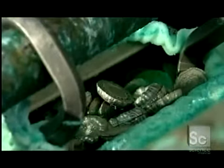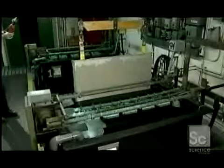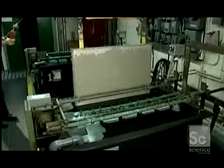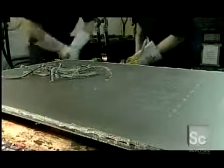Once complete, the engraving will be copied multiple times onto a plastic master plate. Workers coat the plastic with silver so that it will conduct electricity, then submerge it into a bath containing baskets of nickel. They run an electrical current in both the bath and plate. This dissolves the nickel and draws it onto the plate in a thorough and even coat. With the nipping tool, workers remove the excess nickel along the perimeter, then extract their nickel printing plate.